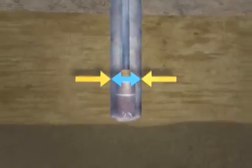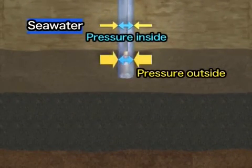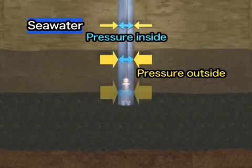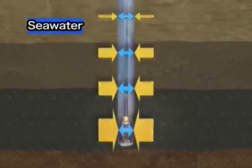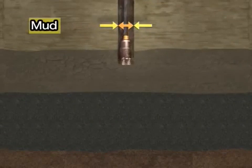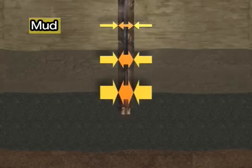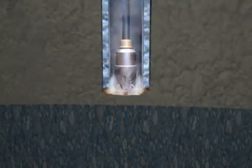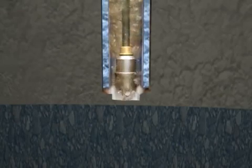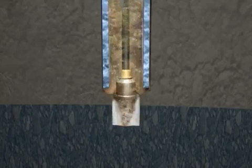Also, with the increase in pressure at greater depths, the formation pressure becomes much greater than the pressure in the hole filled with seawater. The hole will collapse if a certain differential pressure between the outside and the inside of the hole is reached. Mud has a higher density than water; therefore, the pressure inside the hole remains higher and the hole will not cave in, allowing deeper drilling. The drilling mud is artificially conditioned with various products and it is expensive, so discharging it on the seafloor is bad both environmentally and economically. The mud is therefore collected and reused.